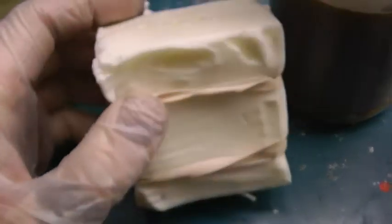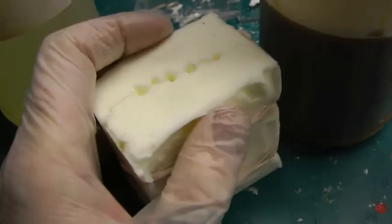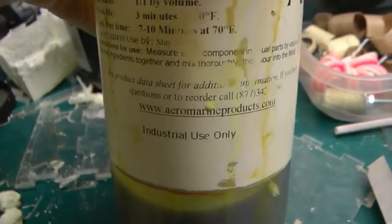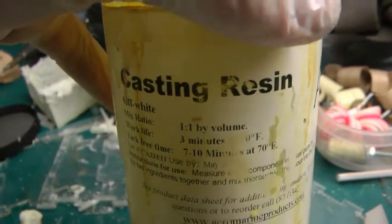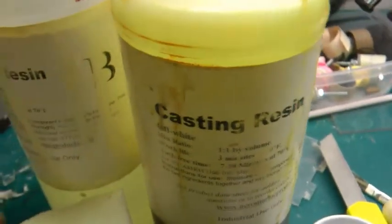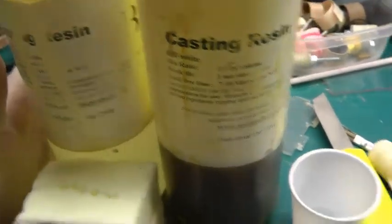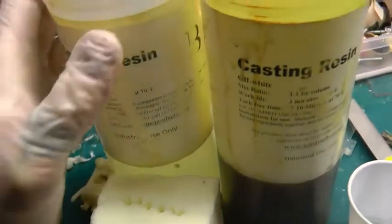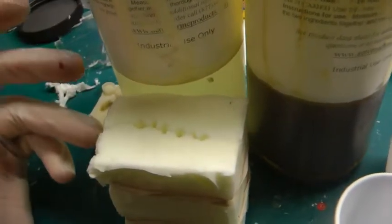So I've widened out those holes and stuck the mold together using rubber bands — that's how I traditionally do it. This is really thick so the rubber bands don't collapse the mold at all; it's really stable now. This is a two-part epoxy that I get from aeromarineproducts.com. It's a one-to-one by volume. This stuff is amazing — it's amazingly expensive too. You could probably figure out it might be cheaper to 3D print all day long than to pour a few.